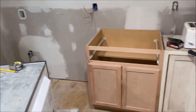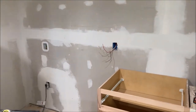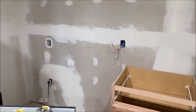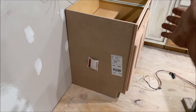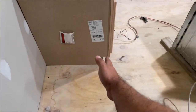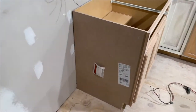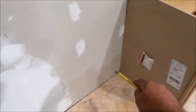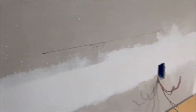All we're doing in this video is getting an idea how to do the initial set-in of the machine. If you have cabinets in your kitchen they have to be in there first — you can't blindly put this anywhere, it has to match the flow of the kitchen. You almost have to have the adjacent cabinet installed so when you build your base you don't go past the toe board or the face of the cabinet. Also mark your wall cabinet height so you know your reference line.